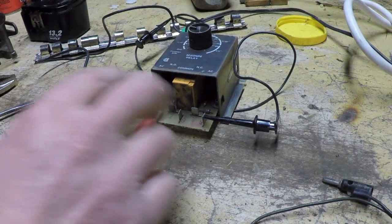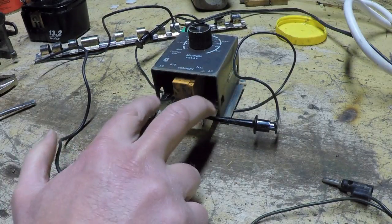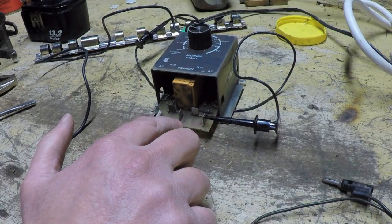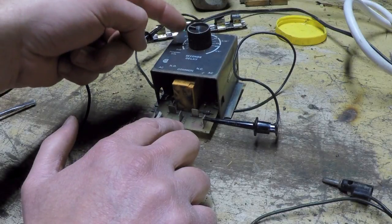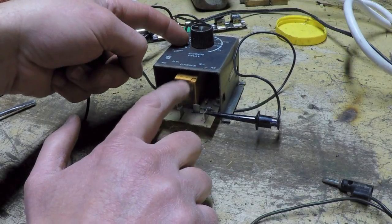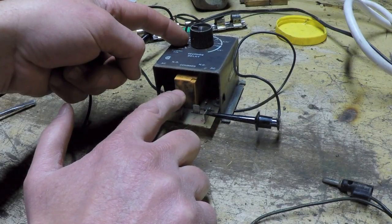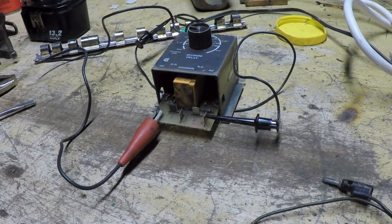So by the same token, what's going to happen in this situation is the contactor on the welder opens, 120 volts is applied to this. The solenoid is being powered through the normally closed contacts. After the allotted time in seconds, the relay is energized and the normally closed contacts open and the solenoid shuts. The gas solenoid shuts. Is that even right? You know what? The easiest way to test this is to just hook it up and see what happens.